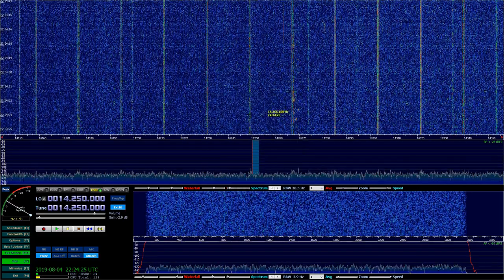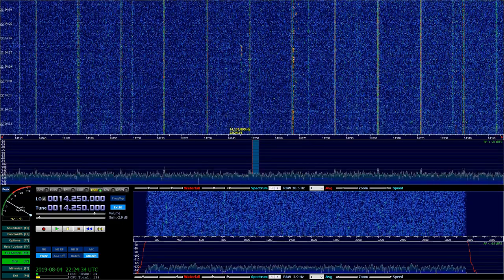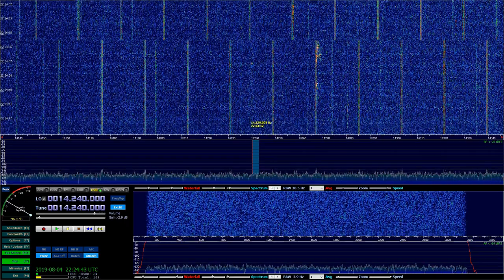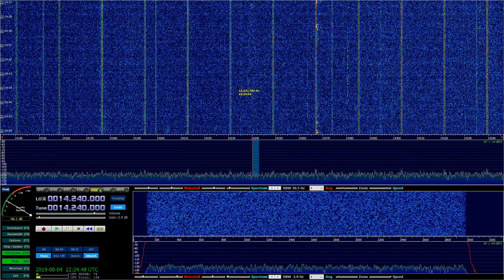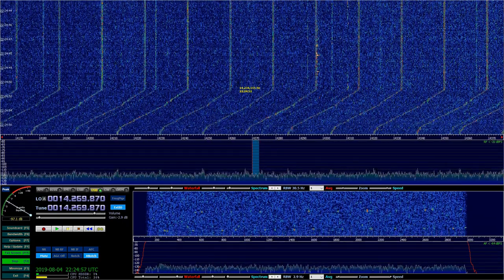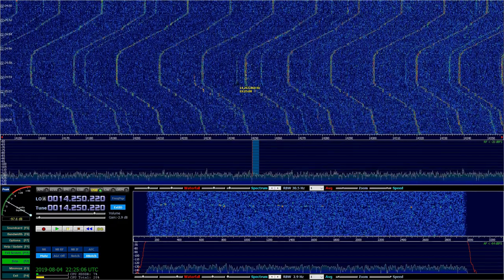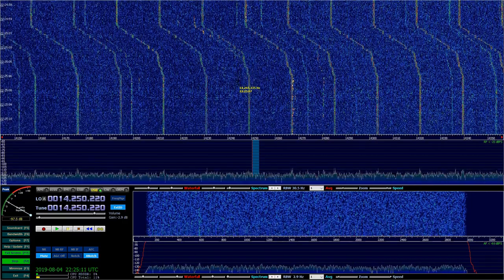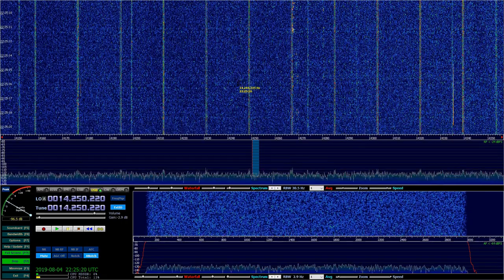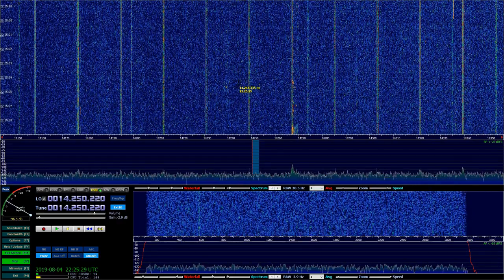I apply it and click here. I'm on 14250 on the radio, and I'm on 14250 here. Let me click here and see if it tunes to 14240. It tuned, but notice what happened — the center frequency of where the center is on HDSDR is now the tuned frequency. Let me spin the dial — look what happens. We're tuning, but that center frequency is not changing. This is because you have a fixed amount of bandwidth on either side of your intermediate frequency. The setup is to have it locked down on the center so you have the widest possible spread. That's basically how you set it up for intermediate frequency output.